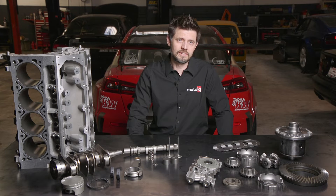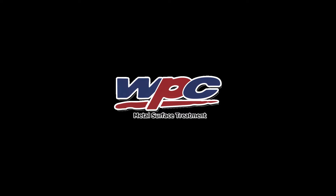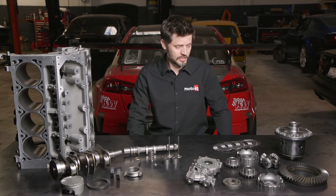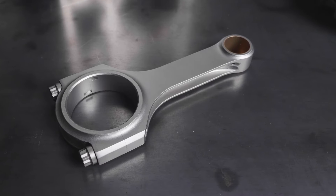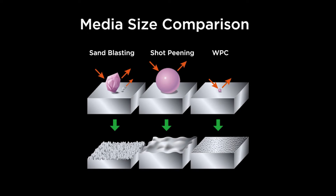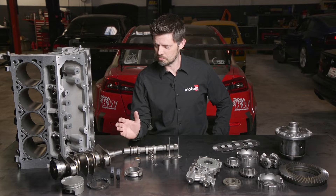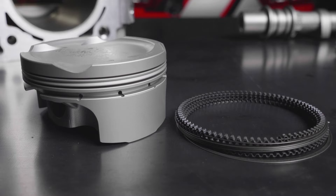If you're watching this video, you might be wondering: what is WPC? WPC is a surface treatment designed to reduce friction and increase the strength of metal parts. As much as it might seem like a coating, WPC is actually a surface treatment. Think of it like shot peening, but the media is much, much finer — like talc. So what you're left with is a super hard, smooth surface that actually has some proprietary dry lubricants embedded within it.